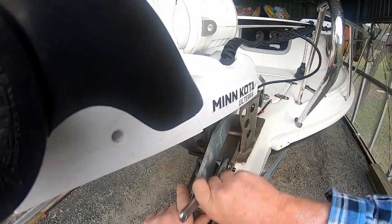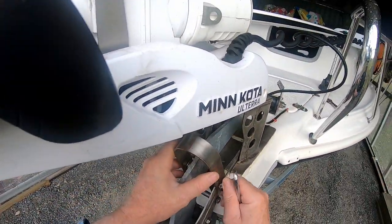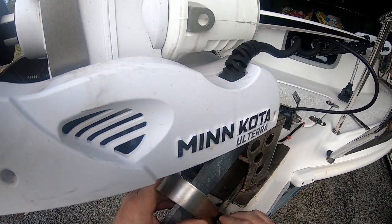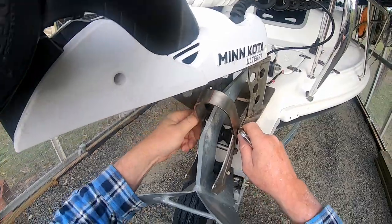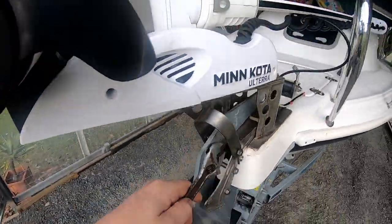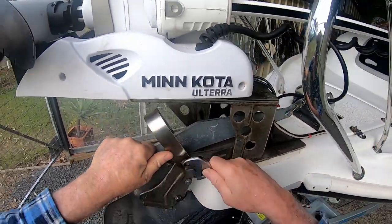As you can see it was really easy to make. Just need a little bit of stainless steel, a hand drill for drilling the holes, and something to bend it around. It attaches to the boat on my bowsprit at least using existing holes that were there and the existing bolts that were there. I just had to undo them and slip this in and do the bolts up again.